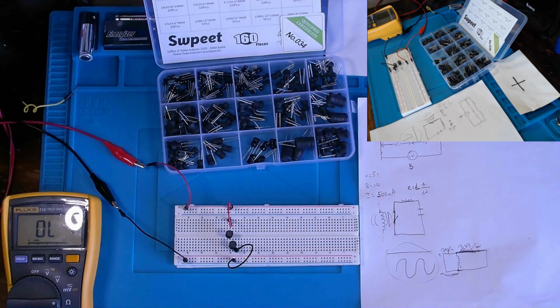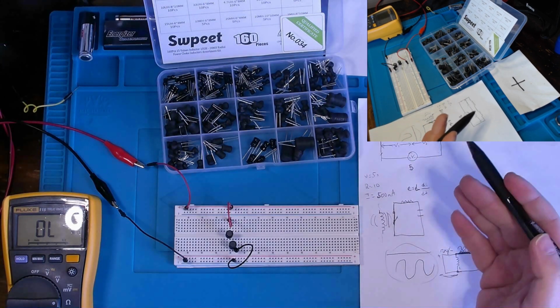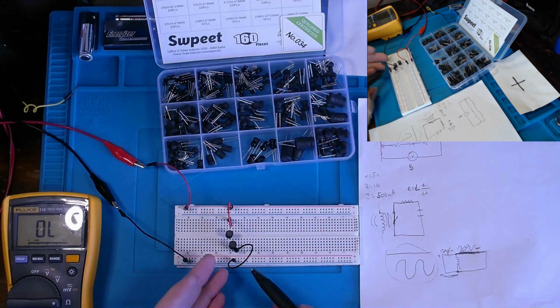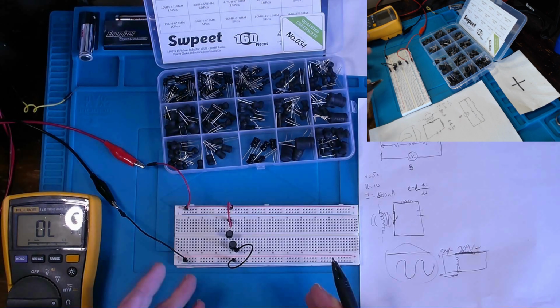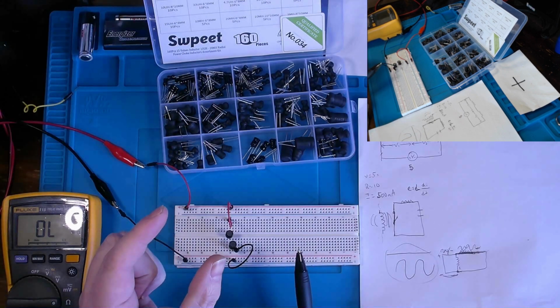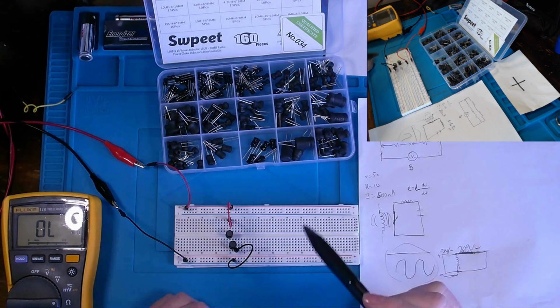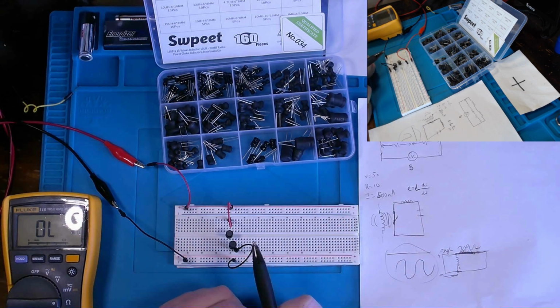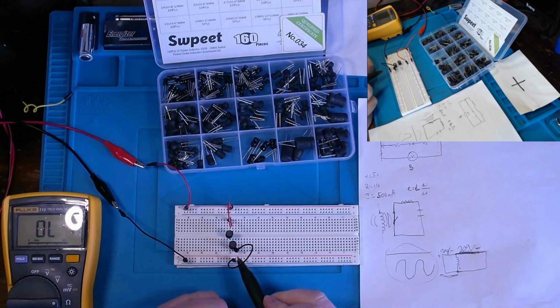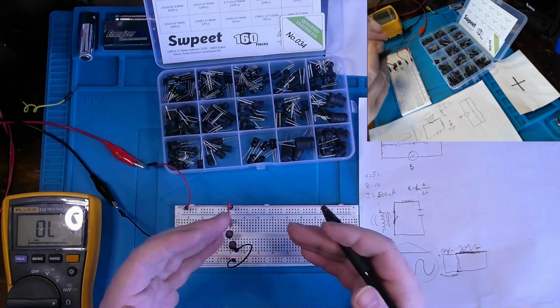Now, one of the distinguishing factors of inductance is that it makes itself felt in a circuit when there is a change in current. So typically you'll find inductors in things like a DC power supply where you're converting AC over to DC. A lot of times they'll be in those wall warts. In the video where I repaired that Four Moms Rockaroo, I destroyed the DC power supply, and on the backside of it I broke one leg off of the inductor that was there to get rid of ripple off of your DC. Again, filtering in that capacity, but any AC ripple should have been filtered off by the inductor.